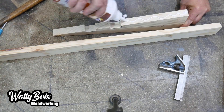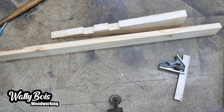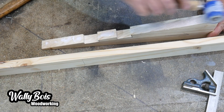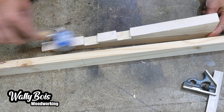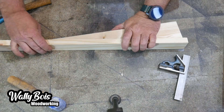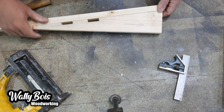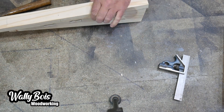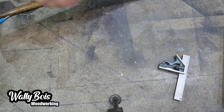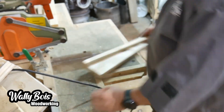So we're going to use a bit of glue — in this case I'm just using PVA. I like to use my glue spreader, which is actually a wallpaper joint roller with a bit of tape on it so you can easily clean the roller by pulling the tape off. It just makes the job a lot easier. I put one nail in just to hold it into place, then put the extra nails in once I know I've got it in position. But we've got to trim the ends — we don't want that big long bit, so they've got to go.